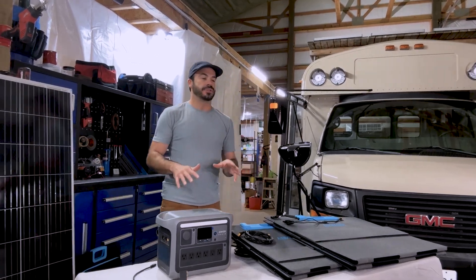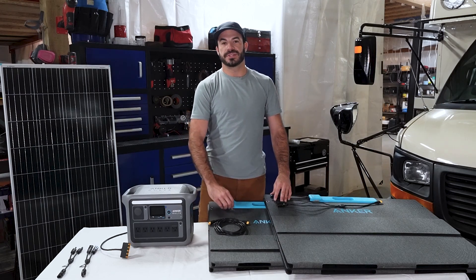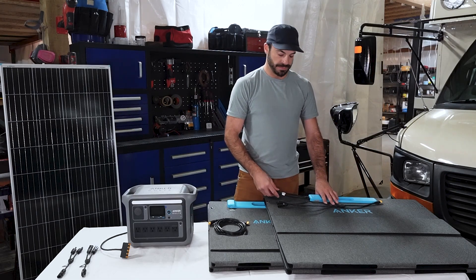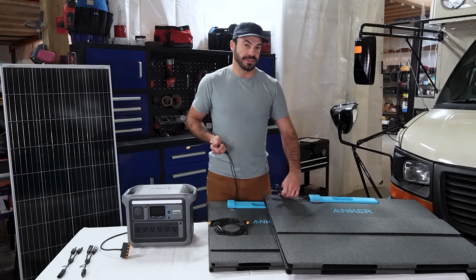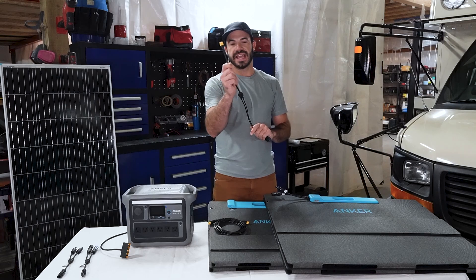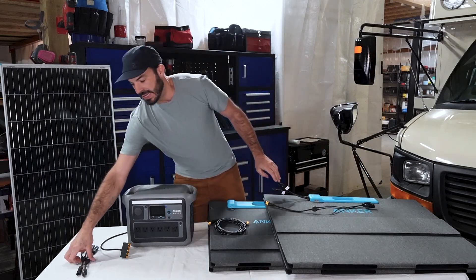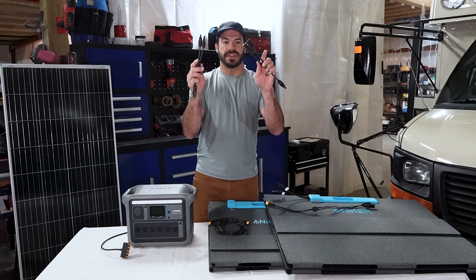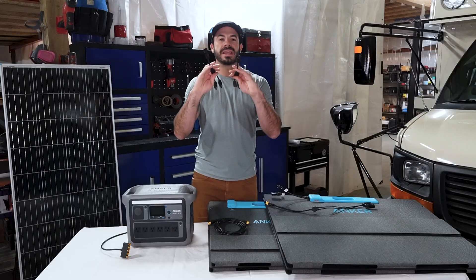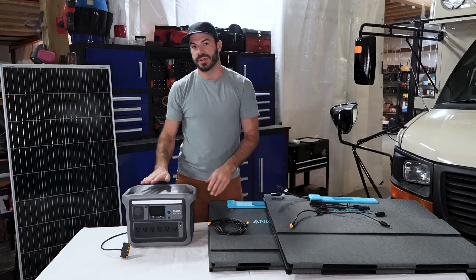When it's time to connect your Anker panels into your Solex system, it's very simple using the supplied connectors. All Anker solar panels either use an XT60 output like this 200 watt panel, or an MC4 output like this 400 watt panel. If you are using an MC4 output panel like this 400 watt unit, it will come with an adapter to get you from the MC4 connections on the solar panel to the XT60 plug that you'll need to plug into your Anker Solex. For connecting panels in parallel, I recommend the use of branch connectors that have MC4 style connectors on each end, allowing you to join two panels together in parallel with one main positive and negative output.